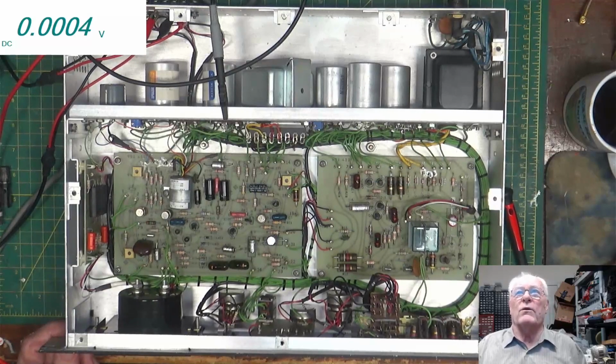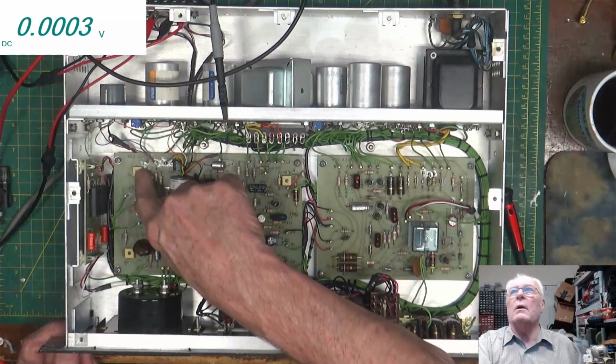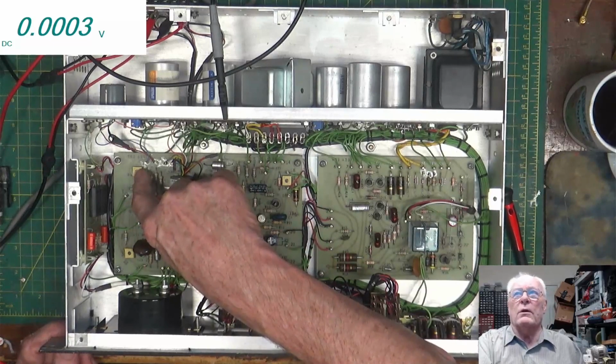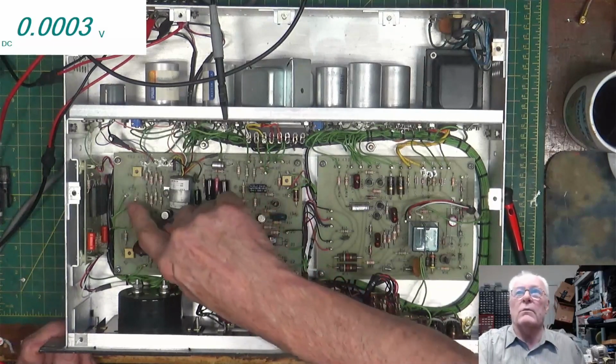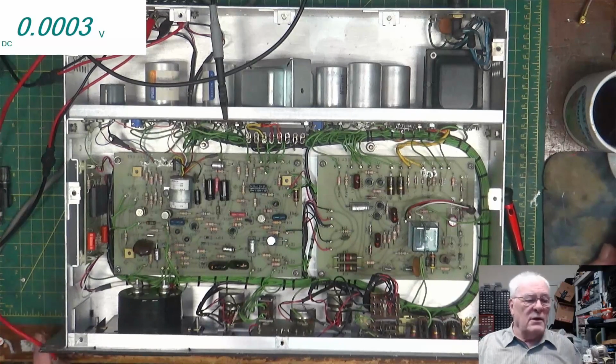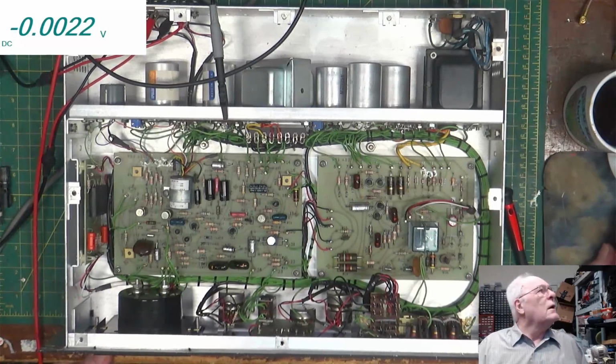The balance, referring to figure 5.1. Locate resistor R8. R8 is over here. It balances Q1 and Q2 for the lowest harmonic distortion, which is right here, and down past the picture. And this is done at a signal level of 10 kilohertz with 10 dB of limiting.